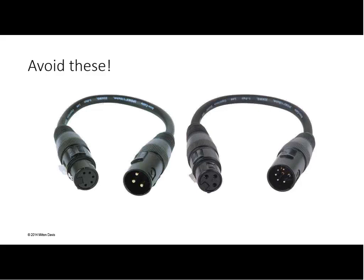Ethernet, that's a different thing. The RJ45 connector is actually very well impedance controlled, and Ethernet will not make it through a rugged connector like an XLR. Others want to add into that? Well, it's also about promoting interoperability. The back of house use of structured cabling is a bit of a concession to how buildings have been wired for the past decade. And because so many contractors understand structured cable, it's suboptimal to use, but it is allowed for things where it's not being plugged day to day and not exposed to the rigors of a show.